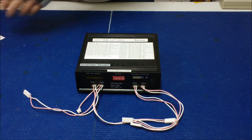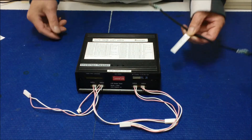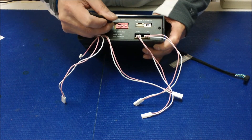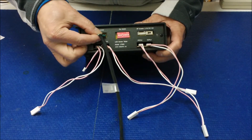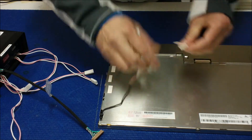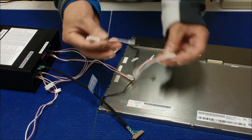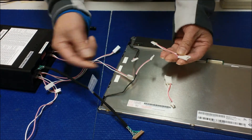The cross-reference table tells us to use the DF14-20P-1LVDS cable at 3.3 volts with jumper 4 on. Connect the grid here. For the 15-inch AUO display, the original connector is slightly wider, so you'll use a wire adapter — our part number is MS196 EXT — which is available online.